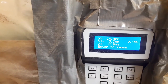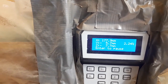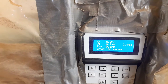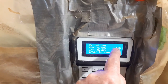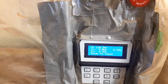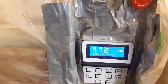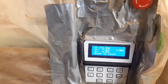You can see the Y is staying constant while the X and the Z move, and then every once in a while the Y increments by a fraction of a millimeter. This shows percent done - when I get up to about five percent I can look at the actual elapsed time and project completion. It's doing about a percent a minute, so it's going to be done in roughly an hour.